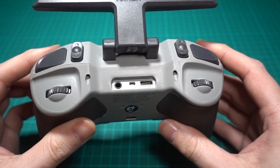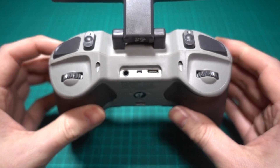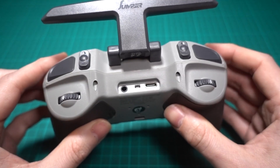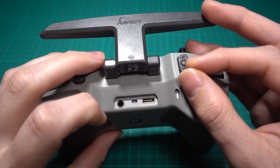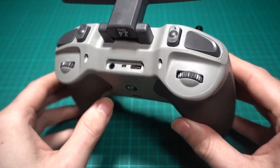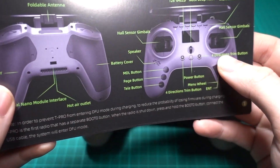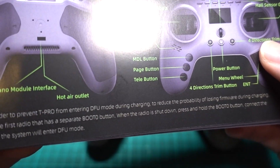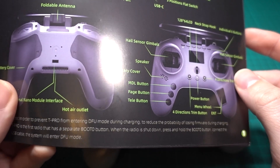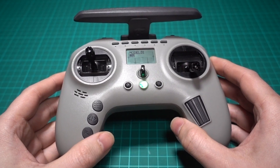So when you pull the charging cable out, it could possibly wipe all of the firmware. If you want to charge the radio via USB-C, you need to turn the radio off first, then press this boot button — which is actually an anti-boot button — while plugging in the USB cable, and it will charge without entering DFU mode. The manual is boasting it as a feature that no other radio has — yes, that's because no other radio wipes the firmware when it's being charged. Just use a separate 18650 charger to avoid any of this mess.